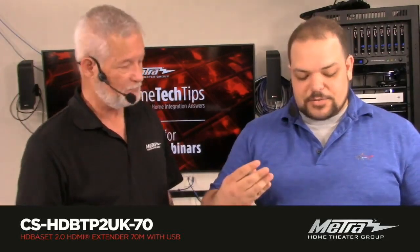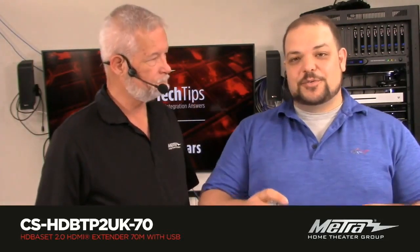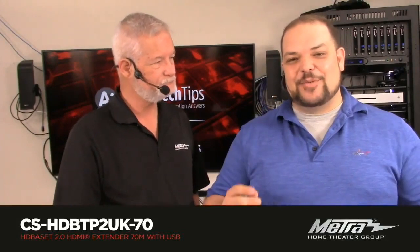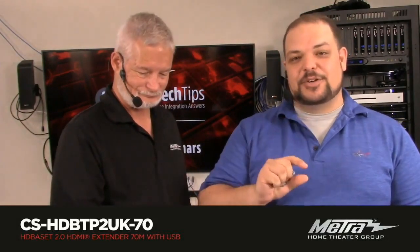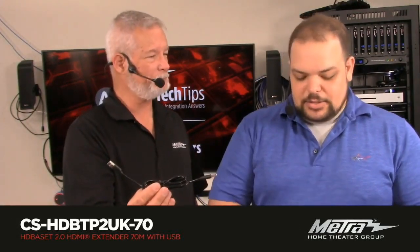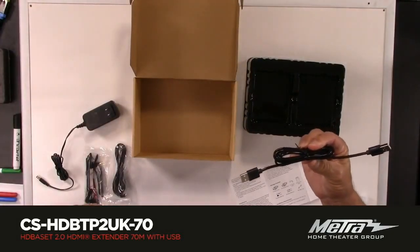So that also means, of course, that you no longer have to take an emitter from your Control4 system or control system and stick it to the IR receiver. You guys who have called in, we've said sorry, but that's the best way to do it. You don't have to. You can do it this way. You can actually go directly from your controller system into the IR system of this and be able to transmit it from there. So why is there a USB cable, Adam? So this system here has the ability to extend USB.